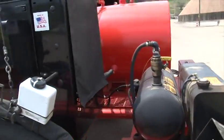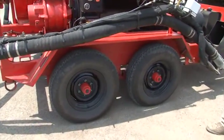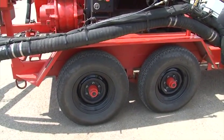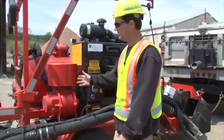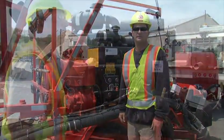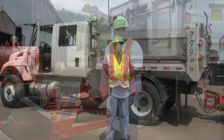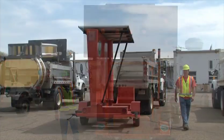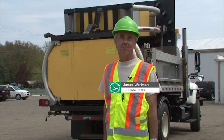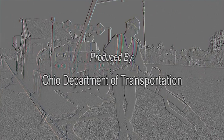Also, on this side, here's the air cleaner for the blower. That should be cleaned out every couple hundred hours or less depending on the conditions. It's vital for that to be cleaned for the blower that blows the material out of the tube. Also, up here at the tank, this is your clean-out tank and your air pressure for the clean-out. That valve has to be shut to build air pressure; you relieve the pressure after the day is out. Other than that, that's pretty much it here. You also obviously want to check the tires — air pressure, make sure they're not flat, and check the suspension and the frame for no cracks. Also, it's a good idea to help the driver check the signal lights and tail lights on the rear of the trailer.